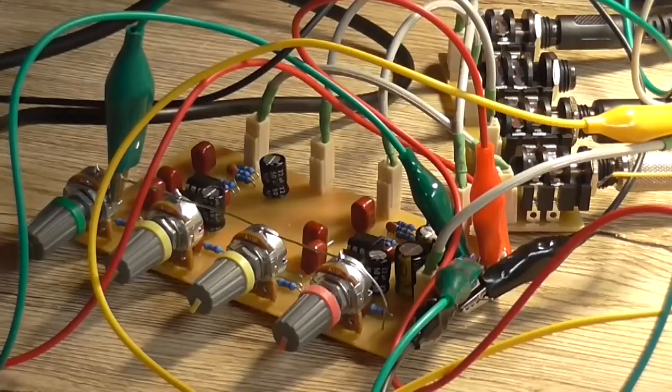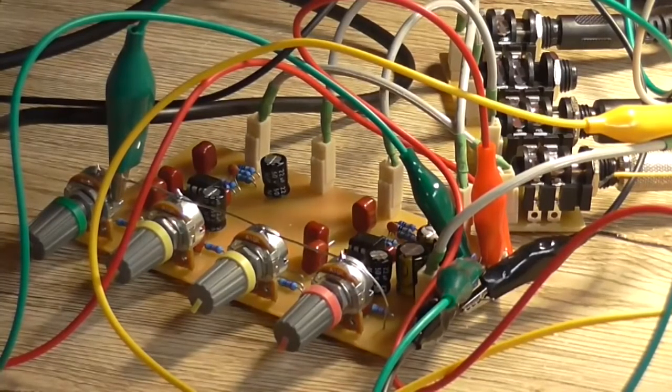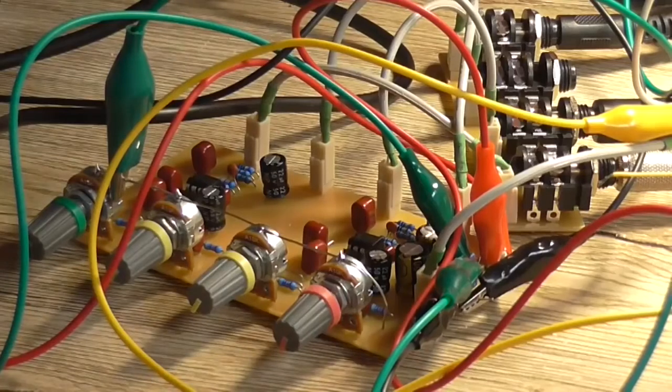That PCB at the front end is working marvellously. I think the CD player line level might have a little bit too much gain, but then again, don't forget we're working with 2 volt peak to peak here. Other line devices such as synthesizers have their own volume control anyway, so it's not too big of a deal there.